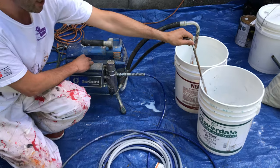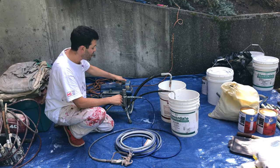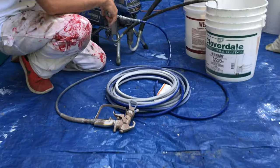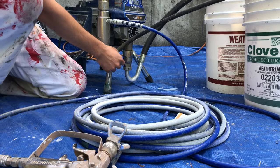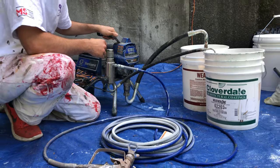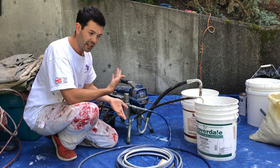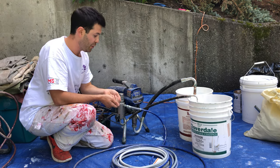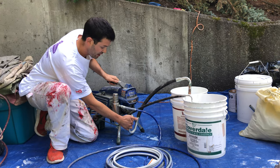I can turn it down and know it's ready — everything works. If for some reason nothing came out of the primer valve, I know there's a blockage or something stuck inside the pump. If it wasn't able to suck it up, I'd take a hammer and hit it gently, because inside there's a ball and a washer. Paint or water can make the ball stick right to the washer — hitting it while it's trying to pump can come loose and clear it. If it still won't work, get a wrench, pull it off, rinse the ball and washer, and reattach it. That's the pump — if it's not priming, there's an issue with something in the pump.